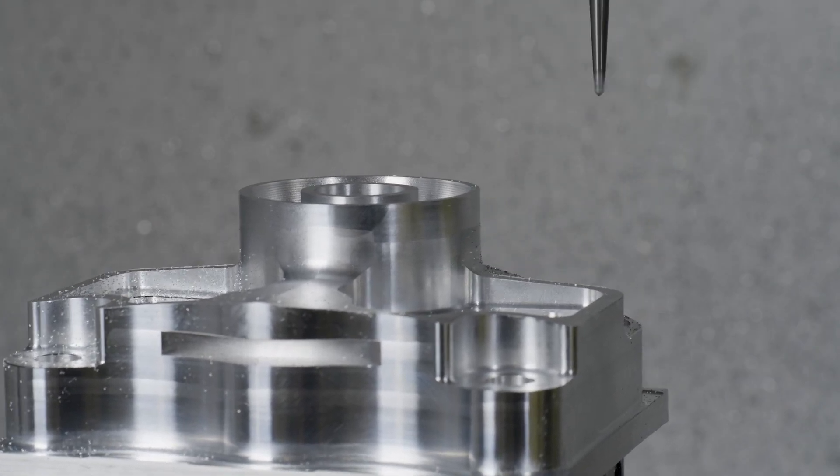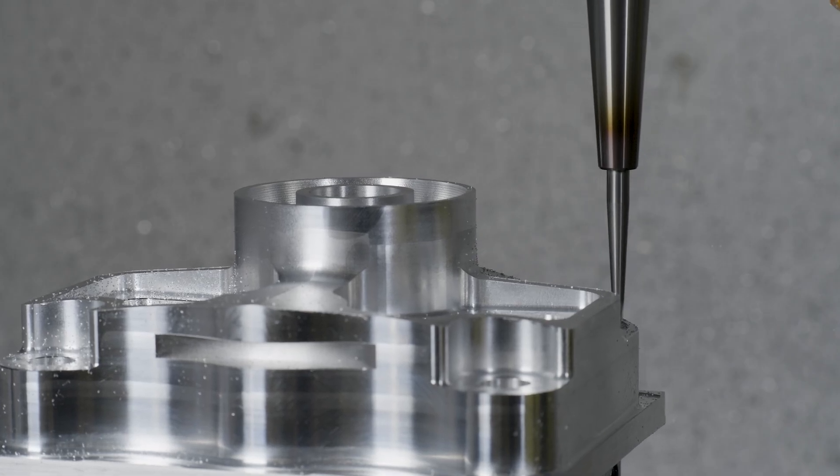Let's talk precision and accuracy, because it's got to work alongside the precision of a component. With the manual process, it's not going to be precise or accurate. Sometimes a chamfer is a critical function on a part and you have to respect the print — it's called out to be a specific size, so you've got to machine that. Deburring is simply when a part calls for sharp edges but you have rough burrs on the edges. It's not critical for the function of the part, but it's much better to run along that sharp edge with a tool and form the most precise sharp edge possible, as opposed to manually grinding or filing that edge.